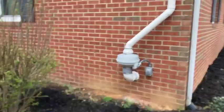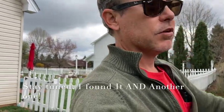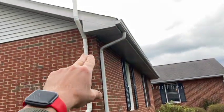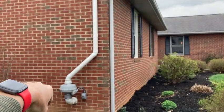There she is — an upside-down fan. This is a conventional fan. The other case where I had success was using an upside-down high suction fan, but there was gravel underneath the slab. I'm really glad I saved that original exhaust — I've been hanging onto it for months, about six months. This is the deal with radon: physical experimentation and patience — patience on your customer's behalf helps. She's been really good to work with, and we shall see how she does.